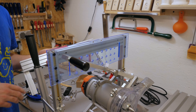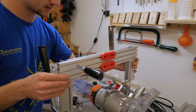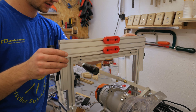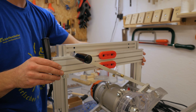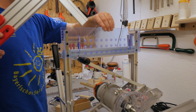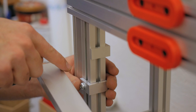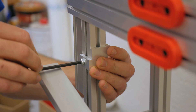Cooldeep also included the new template holder system. Mounting it, there was a small problem: a little bit of play and it wasn't guided fully parallel. I fixed that by enlarging the screw holes — now it slides easily and parallel, just like the other frame. The system has a centering piece for workpieces, but there's an issue: switching to the other template holder causes interference and requires removing and recalibrating the stop. Since you get two pieces, I put the second one on the other side as a stop for the stop — so I never have to recalibrate, I just bump it up and tighten.